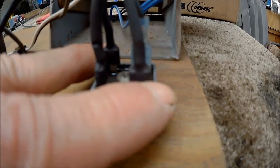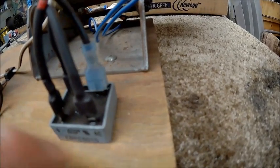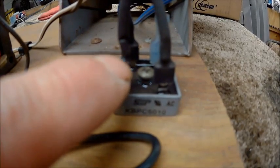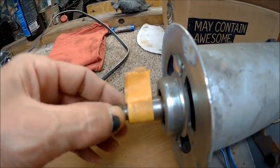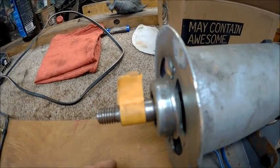Now let's go to the negative. The negative wire on the 12-volt side - remember, this has got a plus for the positive, so we're going to put that on positive. Now if you need to reverse your motor, you can take and reverse the red and the black on the 12-volt and it'll reverse the motor. Now remember, if you do reverse your treadmill motor, you want a pulley on the shaft that has a set screw. So if you're modifying a treadmill motor, you're going to use this shaft right here and put a set screw on there to hold your pulley on it, and we're going to cut this off because we don't need that anymore.